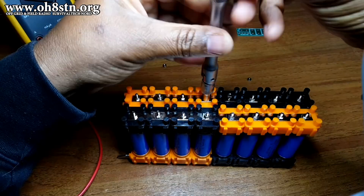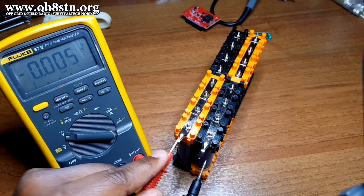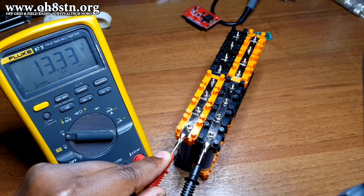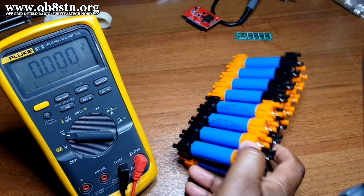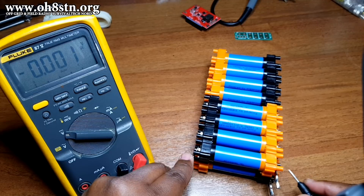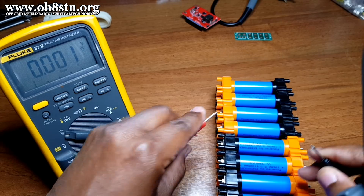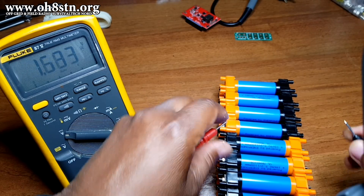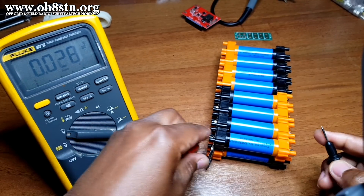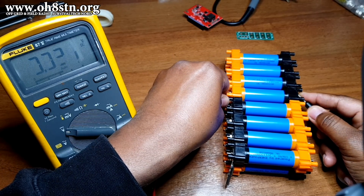Even with the time-lapse video, that's all pretty clear. Now we can do one more quality inspection with our multimeter to check the overall voltage of the pack. I don't just inspect the voltage of the entire pack — I also inspect the voltage of the parallel sets. If you did the quality inspections along the build, the voltage should be exactly what you expect it to be. Once you've validated good voltage on each parallel set, we can go ahead to setting up the BMS and the output wires.